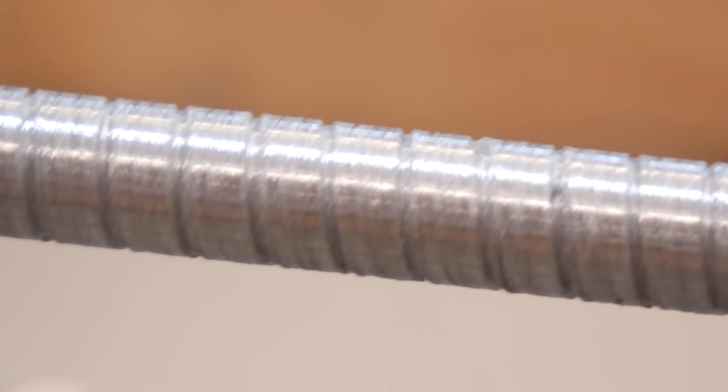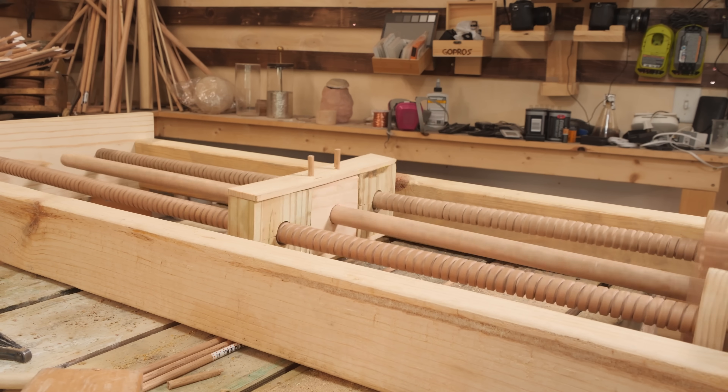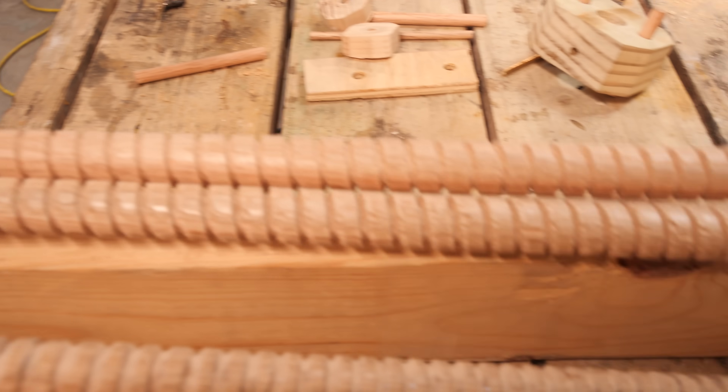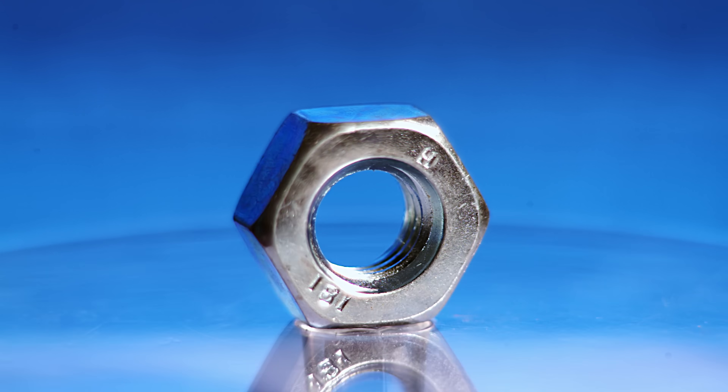With all of Elliott's improvements, we were able to get the machine up and cutting pretty well into a metal rod. The big thing a lot of people commented on was using the machine to make improvements to itself to make a better machine. The big issue I ran into is I haven't found a really good way to measure the thread to determine if it's getting more or less accurate as we do iterations. I tried using a gauge to measure it, and as far as I could tell it was actually pretty consistent. So I figured the ultimate test of precision is to basically try and recreate a store-bought thread — see if a store-bought nut will actually fit straight onto it. If that nut fits and stays consistent, I think that's a pretty good sign we have a precise machine.